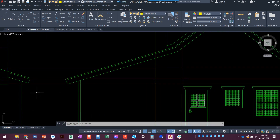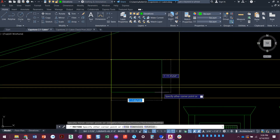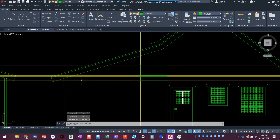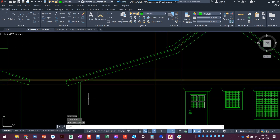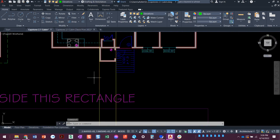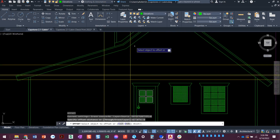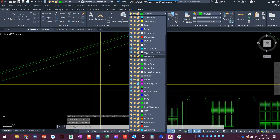Come back to the elevations layer and draw lines or rectangles — whatever you see here — that is how big these things are. I did not project down my roof overhang on those. The roof has a six-inch overhang on these sides, so I'm going to offset that six inches this way, and that way.